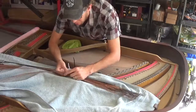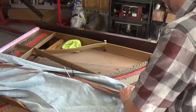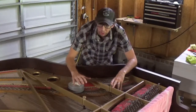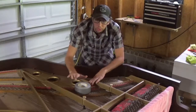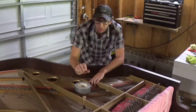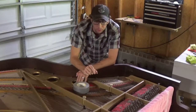Lastly, I'm going to tie together the last set of strings there. Now that we're done with the bass strings, we're working on the treble wires. What I'm going to do is take some duct tape and sandwich them so that they stay in order. The reason we want to keep these in order is because even though we're not going to special ship these to some string maker, we do have to know the gauge or the thickness of the strings. So I'm going to sandwich all these strings within each section with some duct tape and then take my measurements so I can do it a little bit more precisely outside of the piano.